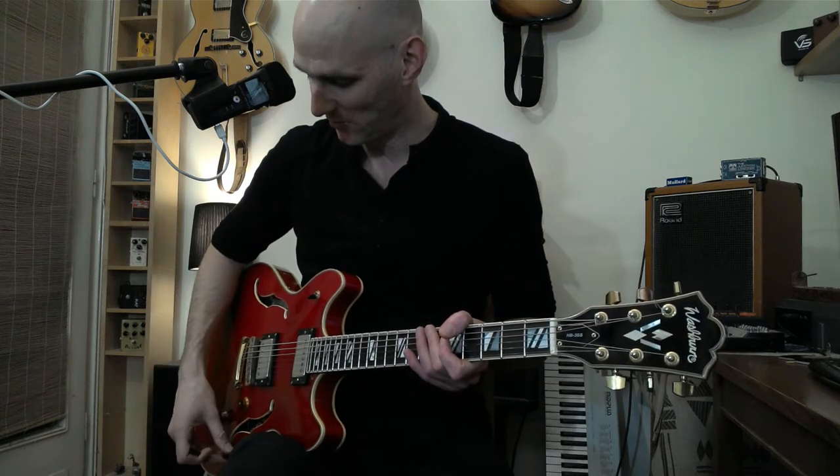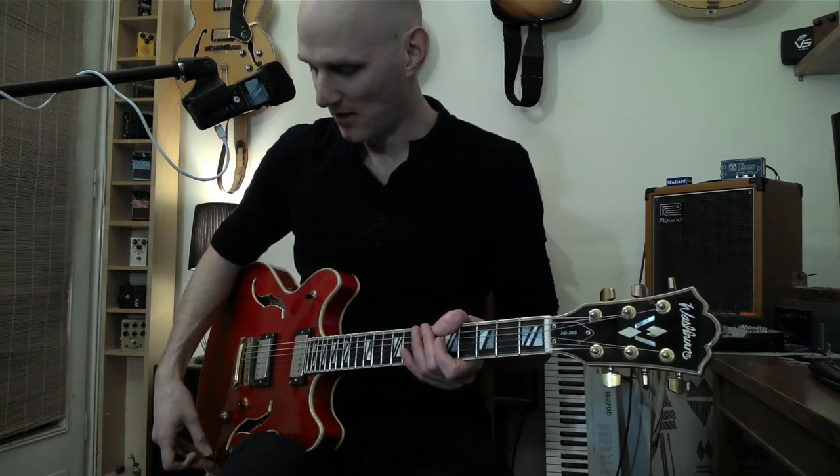This is why in general people tend to use 250k pots for, let's say, Strats, Telles, single coil pickups, because they tend to be pretty bright already. If you'd add a 500k pot to, let's say, a Telecaster, I think it would make heads explode and ears bleed, but they might be the thing for you. So anyway, there are just some things for you to consider out there.